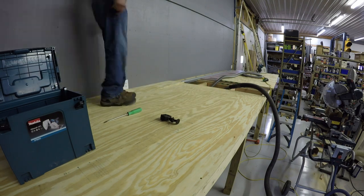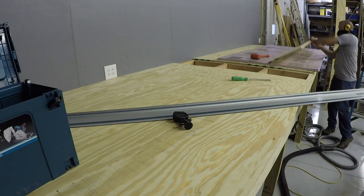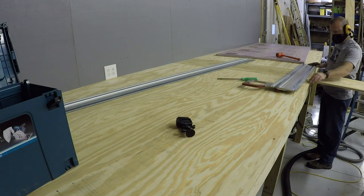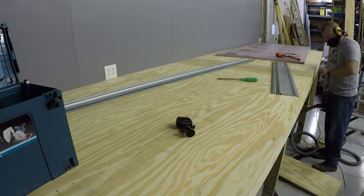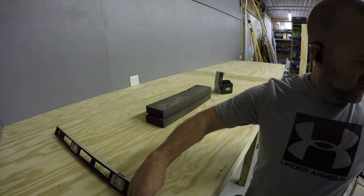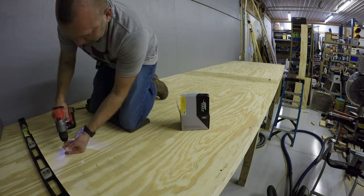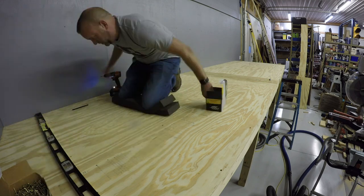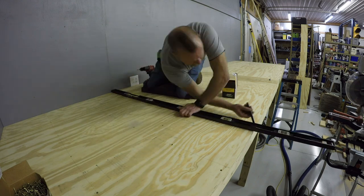A nice, perfect, snug fit. Now I'll do the same for the other side and rip a section for the middle. For the middle, I'm going to cut its length in place using my short rail — this will allow me to cut it to perfectly match the pieces on either side. I'm a bit anal about screw placement and having everything spaced evenly, so to help put the flooring screws in at even placement, I'm marking my level for each screw placement. I can then also use the level to make a line from the wall to the front edge, ensuring I'm hitting the joists.